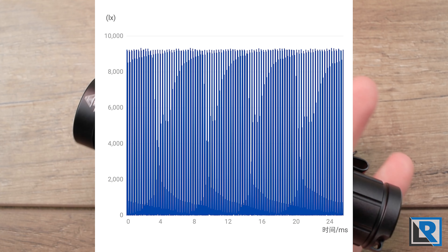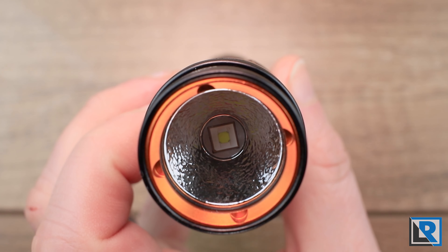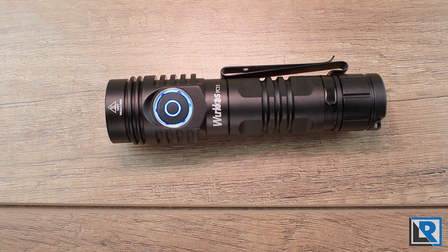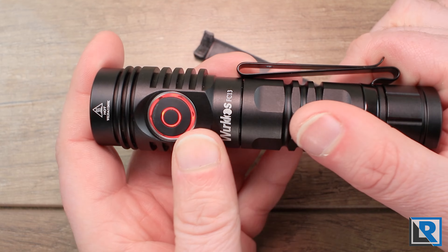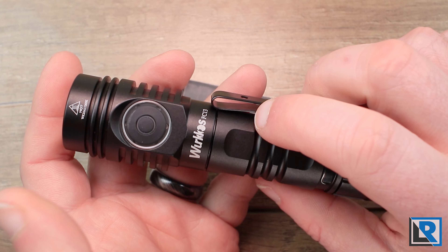There is PWM as you'd expect with an Anduril light. The beam has a small hot spot with minimal spill, which is expected from the flat-top SFT-40 — it's more spotty and built for throw. I measured parasitic drain with the LED on high (standard mode, not multicolor) at 5.5 milliamps, on low at 156 microamps, and with the button off at 46.2 microamps. At its brightest RGB mode, the light will drain from full to empty in less than a month. I'd recommend turning it off for storage, or use mechanical lockout — just loosen the body slightly to break contact.